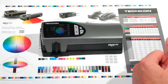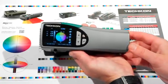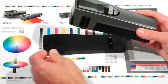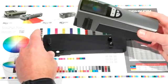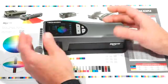Calibration is done on the same base. To calibrate, you dial out the ceramic white calibration tile, set the instrument on the base, then select the calibration icon and press the green measurement button. That's all there is to calibrate the device. To protect the white ceramic tile from paper dust, ink, and other materials found in the press room, you just turn the dial back into the base, which completely inhibits any damage from occurring to the ceramic tile.